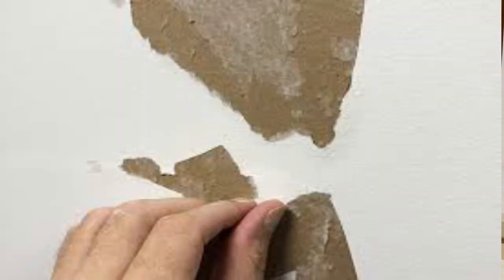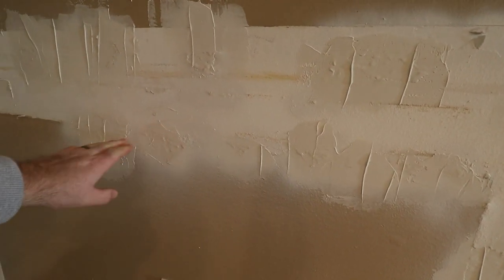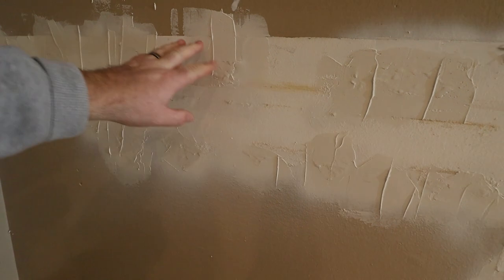If you've ever repaired drywall when the paper backing is exposed, you get a bubbling action. It is horrible to fight — you put your wet compound on and it just bubbles up, kind of like what we've got going on down here. I sprayed a little spray paint on there to try to seal that bubble as much as I possibly can, because when I go to sand this stuff down it's going to be an absolute nightmare.